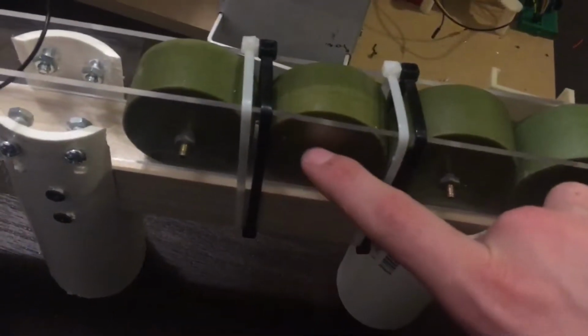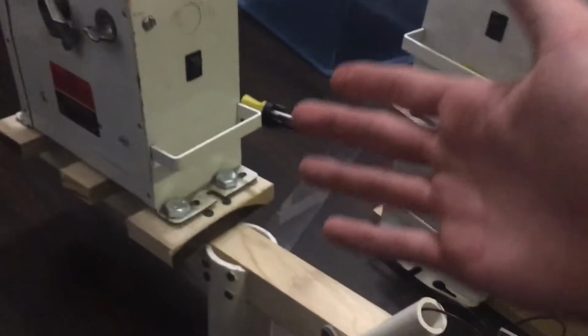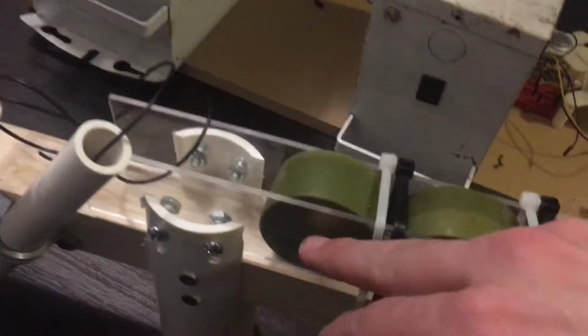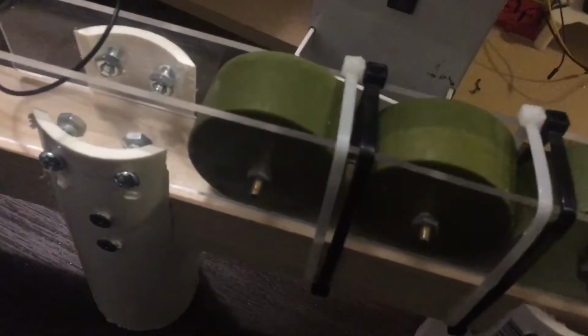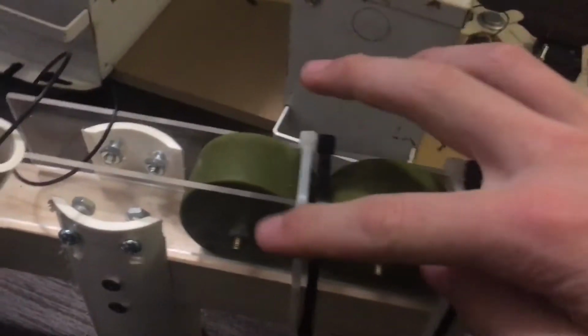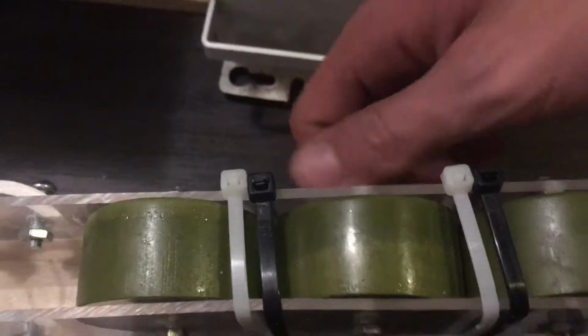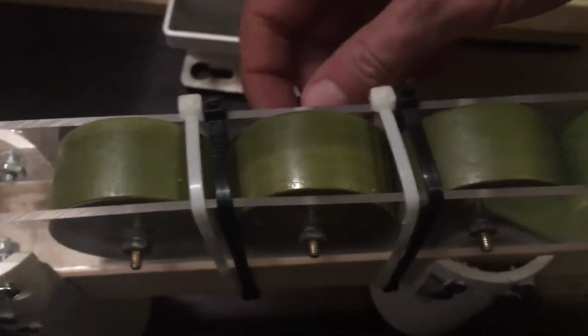And also the resistors connecting these two, they can be very expensive because they have to be high voltage, 4,500 volts at the minimum, and they also have to be 1 mega ohm resistance. So finding those specs could cost you $15 a resistor, but I got mine for pretty cheap because of an eBay offer. I ended up getting 550 of them for like $30.